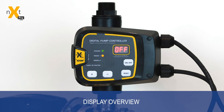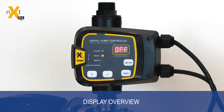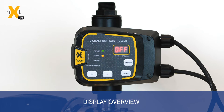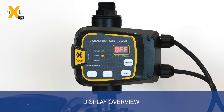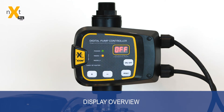The NEXT Pro Controller comes pre-fitted with a digital display. The key areas on this display are as follows. Firstly, the LED display — it can show you items such as active pressure, active current of the motor by pressing the reset button quickly, and any error codes the system wants to display. You also need to know about the LED power light to tell you when the system has power, the mode one and mode two LEDs to indicate the operational function mode, and of course the lack-of-water light, which assists in displaying errors but also tells you when there's no water available from the source you're pumping.